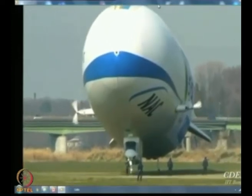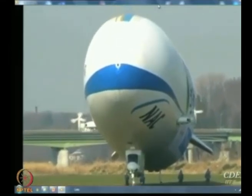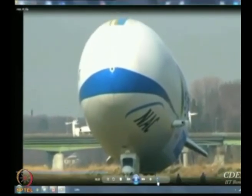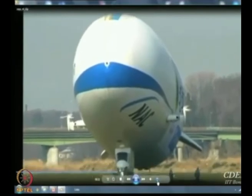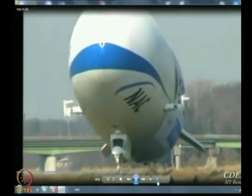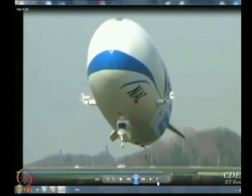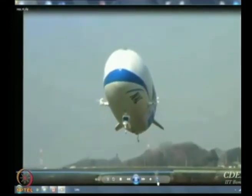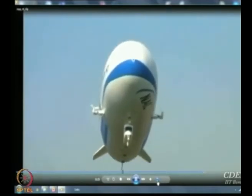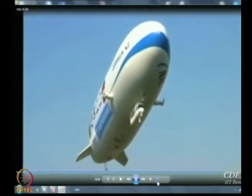There will be just one central mast man and three people. This is what Zeppelin NT claims — ground handling by only three people, because here the two engines on the sides and one on the back (not visible) are used to provide the required forces. Employing so many people at every location where you take off and land is very expensive and can increase costs enormously. So one of the key contributions of the Zeppelin NT design is to make the airship essentially free of large ground crews — only three people are needed on the ground.